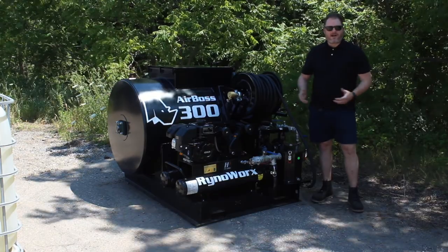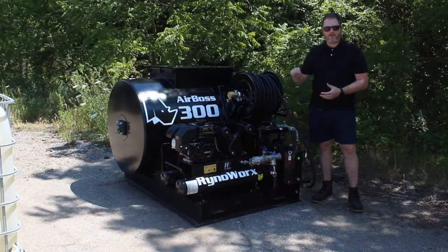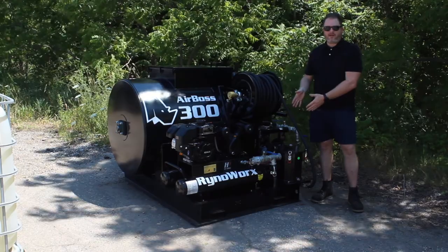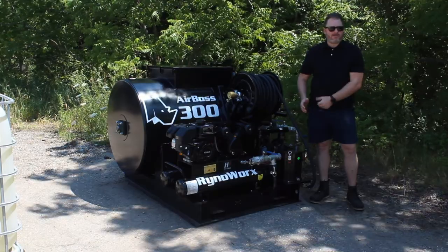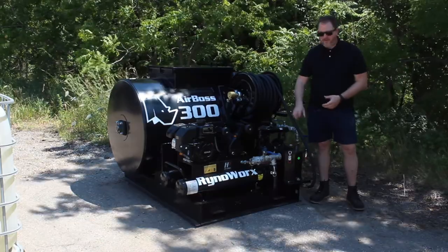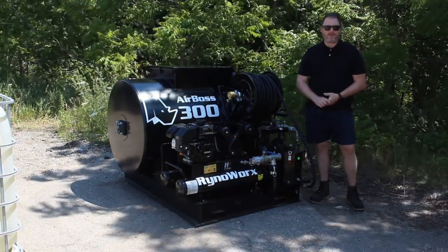It's also got a three-US-gallon basket-style strainer. Inside is a removable basket with four-millimeter holes that helps prevent sludge from getting into your pump system. The unit has four quick-release levers so you can quickly pull up and clean your filter. Some units require you to twist off a bunch of threaded knobs — this quick-release design is a lot simpler.